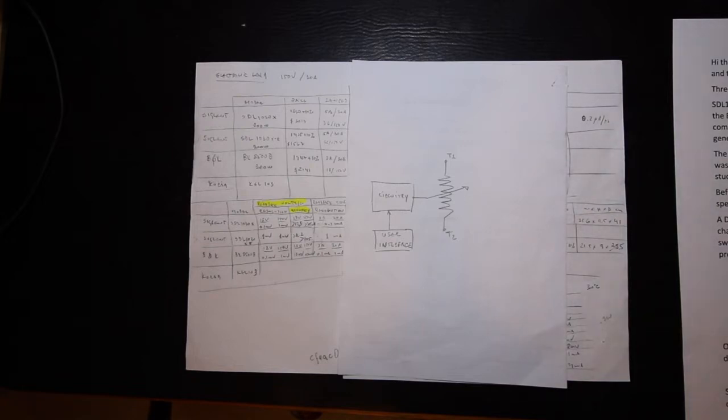Resolution is the minimum amount you can program for the voltage, current, resistance, or power, and accuracy is the minimum amount the circuit is really able to set. Readback resolution are the final values shown on the screen for the voltage, current, resistance, and power, and readback accuracy are the real values set by the circuitry.